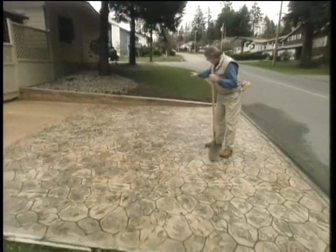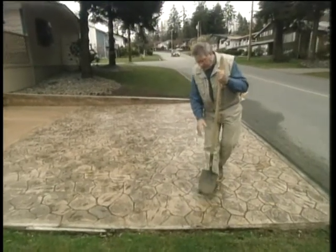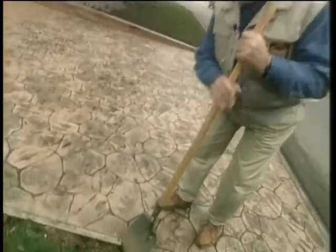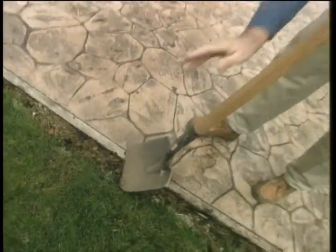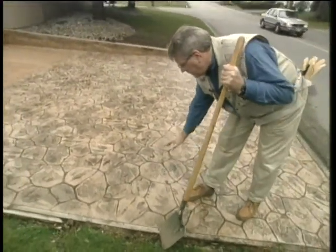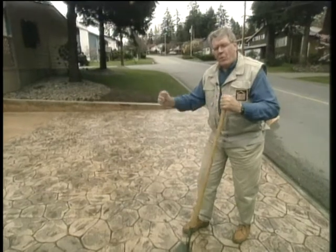It's going to come up against that wall, down underneath that slab, and it's going to get down here to the point where it's wanting to exit, but it runs into some fairly hard soil. And there's also some clay in there as well. The water will build up and back up in underneath that concrete slab. And if you ever get cold weather, away it goes. Crack, just make one heck of a mess.